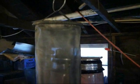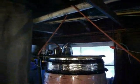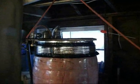This is a 100 micron filter sock that we use to filter out solids before they go into the centrifugal filter. Cigarette butts, french fries, dough, batter, whatever. We run it through there before we run it through anything else to save wear and tear in our gear.